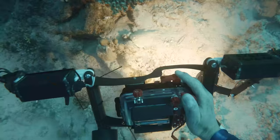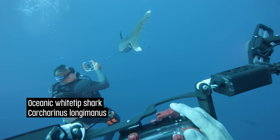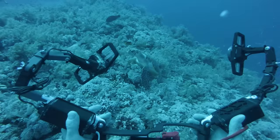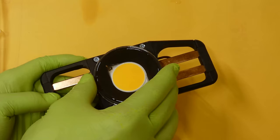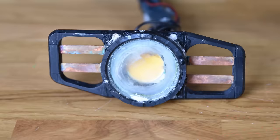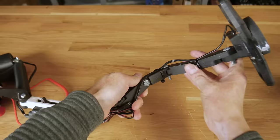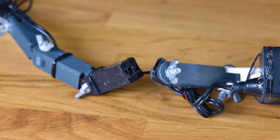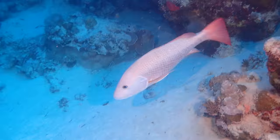The question is how did it survive repeated diving? This was finally the first working prototype and it served the purpose surprisingly well. However, we still found several areas in need of improvement. First, the bond between plexiglass and epoxy resin is simply not the best option — sealing it with silicone and securing it with screws would be much better. Second, stranded wires can be cut or pinched and suffer from corrosion, so we suggest adding extra protection by putting them in a rubber tube. Third, the arms holding the light are weak and need improving — they were printed several hours before departure as there was no time to design anything better.